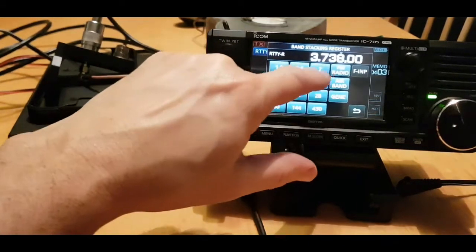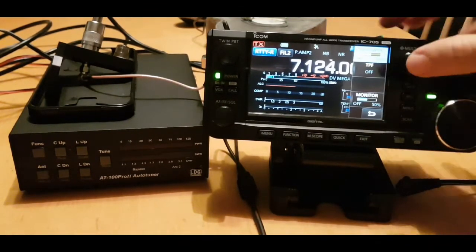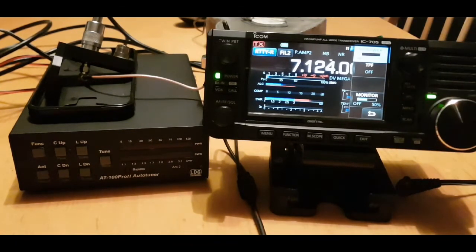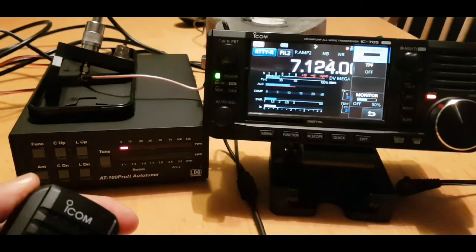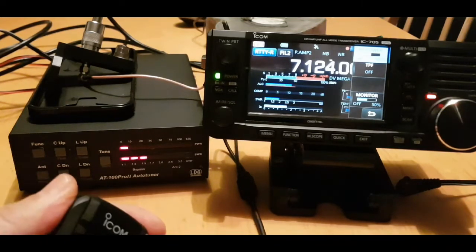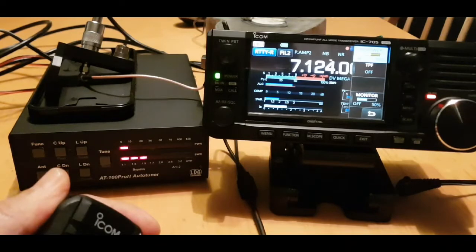Let's go to 40. Let's try it really low - let's try it at 1%. You can see nothing happens. Without the DC cable connected, at 10% we start to get a tune. So 10% of 5 watts - I'm not a mathematician - is that 0.5 watts? Half a watt does start to trigger the tuner. At two and a half watts we're still getting 1 to 1.5 ish, a bit higher. It doesn't really want to tune any lower than that.